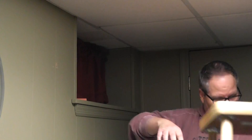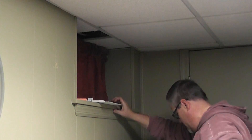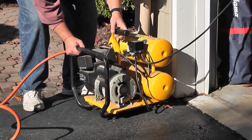While I'm down here, I go over to the other side of the basement. There's a little trap door here with another shutoff valve. That one goes out underneath the sunroom to the two spigots on either side of the sunroom. Then I fire up the compressor and run the air hose to the front of the house.